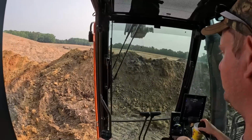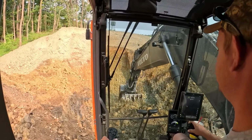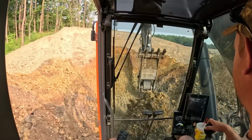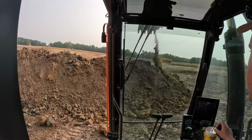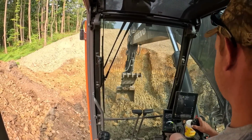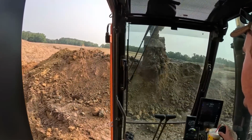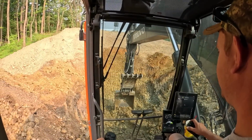It's kind of like that rock clay, but no digging, it smokes the teeth. So I'll get in here and put that clay in here real good and make a good solid core for this pond, and everything should be good to go. Laying all this dirt right here on the front edge. This will be the toe of the slope.